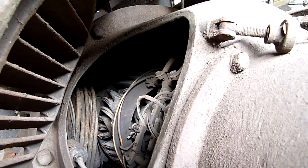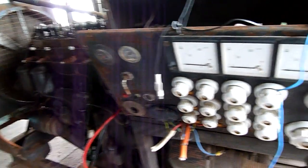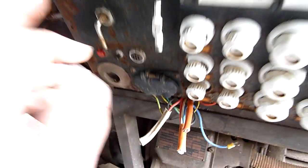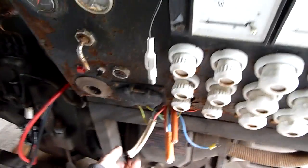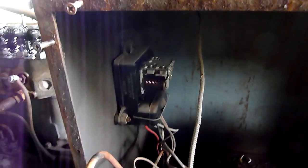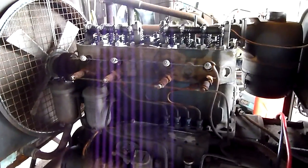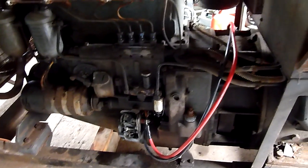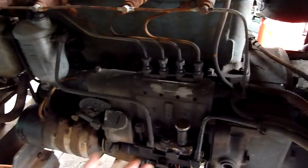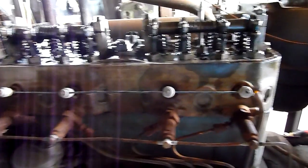Inside, some of these windings — at least one winding — isn't like the others. I've got two combinations at 50 ohms each, which seems standard, and one at nine ohms. I think it's the center phase. I think they overloaded one phase instead of splitting across three separate single phases — they ran one single phase plus a couple of three phase loads and blew one winding through imbalance. That's a pretty common mistake with three phase generators and even three phase supply; it creates a serious issue. Part of the safety check is making sure the governor fuel shut-off works. I've got the flare nuts cracked so even if the pump goes full on, it'll just spit fuel out here instead of firing into the cylinders and going runaway — that would not be fun.